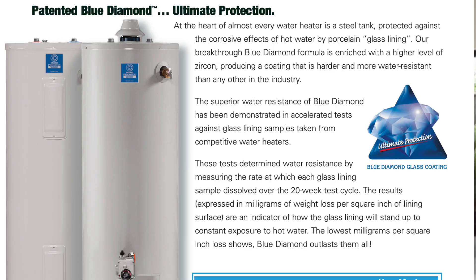One of the best glass linings made is called the Blue Diamond glass lining, that State Water Heaters manufactures and invented. In fact, even other manufacturers of water heaters use it. This lining is a glass lining, so to speak, but it's also got a little bit of flexibility. Because on a gas water heater, when you fire up a burner underneath the steel tank, what happens? Expansion and contraction, right? Steel expands when you heat it. And then if you dump cold water back in there from the hot water, it contracts. You can't just have a piece of glass because glass doesn't expand and contract, but the Blue Diamond lining does.